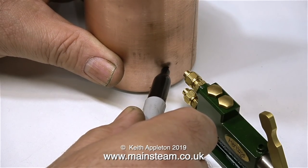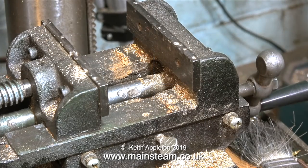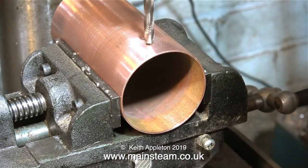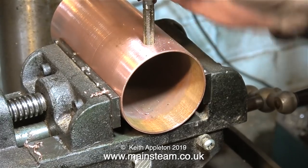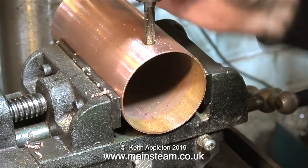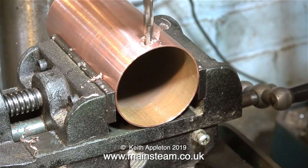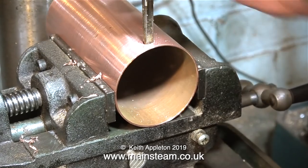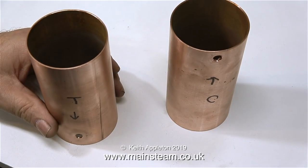When I lift the copper tubing off the bench to simulate the thickness of the base, you will see that it's just about the same height as the union on the inlet to the pump. So now it's over to the drilling machine to drill the holes in the copper tubing — and here is a very rare sight of me actually using a vacuum cleaner to clean up my machine tools. I'm drilling a hole two imperial sizes down from 5/16 of an inch, which is 9/32 of an inch, and here I'm using an ME 5/16 by 32 threads per inch tap to cut the thread in the copper. ME stands for Model Engineering. That was the water tank, and this one is the condenser — I'm drilling this hole nearer to the edge of the copper tube, after which I thread it the same way with an ME 5/16 by 32 TPI tap. I've written T for tank and C for condenser on the tubing just for the video.